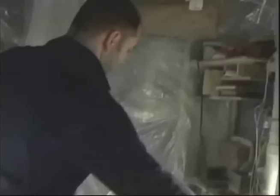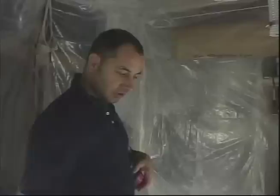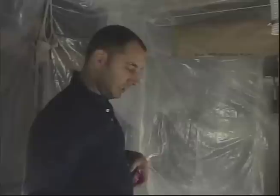Funnier things have happened, and on this one we still have one more chance. A lot of times you'll run into problems with your resin ratio being wrong — that'll create funny little patterns. The more you do it, the more you'll see what happens, what to expect, what not to expect. But this isn't perfect, it's not bad, and we still have one more pour. So I'm going to plane off these chunky bits, put the last layer on it. The three pours on each side, and the only thing different on the last layer on the top will be a tape job to eliminate this kind of dripping on the last pour.